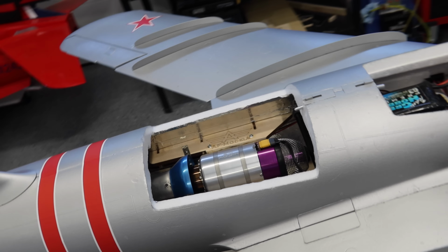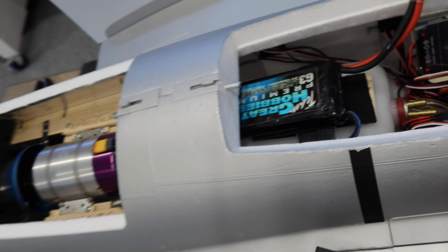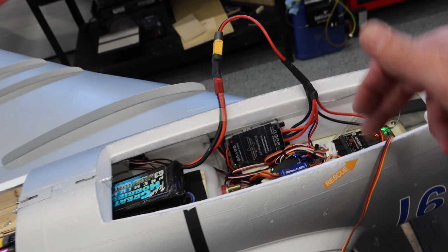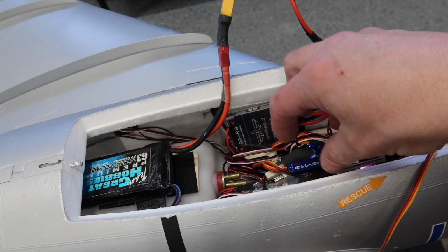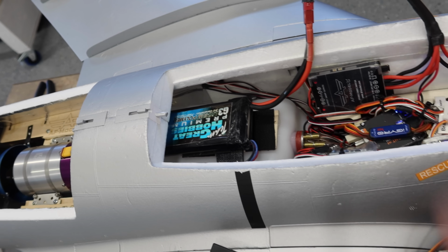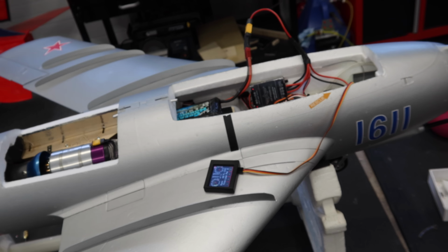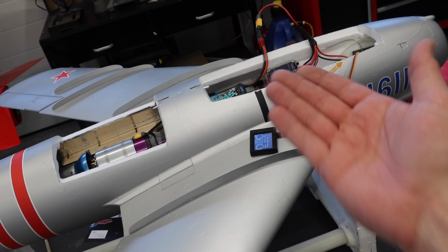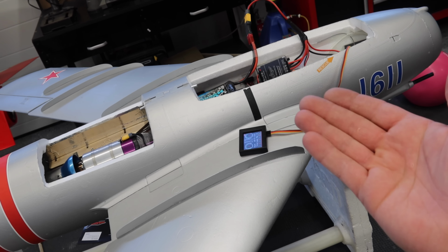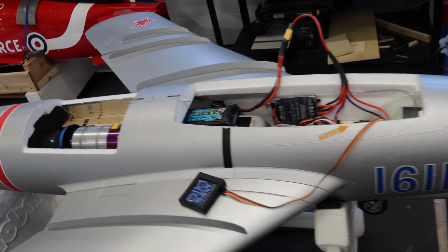So next thing we need to do is take this aircraft and run the engine. One of the keys when we do the center of gravity check on this aircraft is we want the bubble trap, which is right in this location here, to be full. And then we want to have some fuel in the main tank. Basically a landing amount of fuel is what we want. So we're going to fill this fuel system up, we will do our test runs, then we'll drain it to a proper amount of fuel, and let's run this thing.